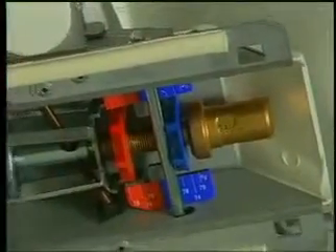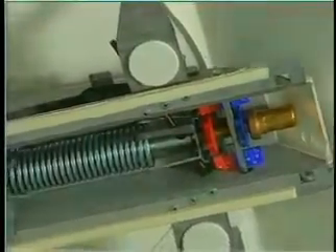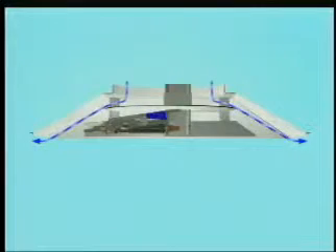When the room cools, the wax contracts and the spring pulls the room thermostat inward. This pivots the control arm up, closing the damper. In practice, the air flow reaches a point to satisfy the room load and the damper simply hovers around that point.